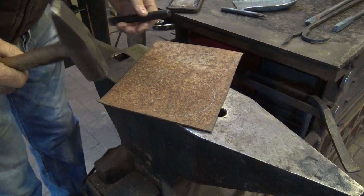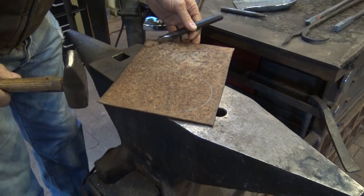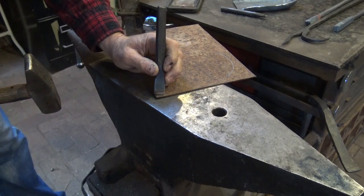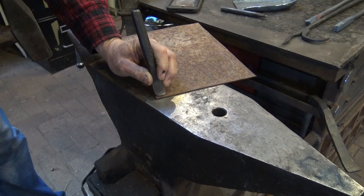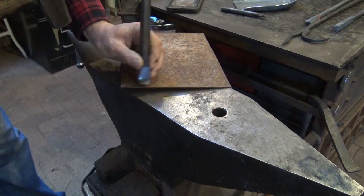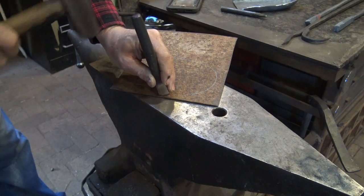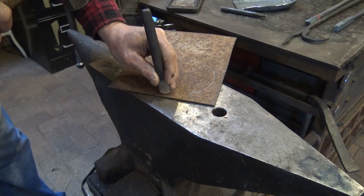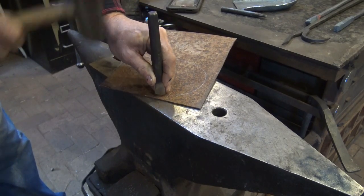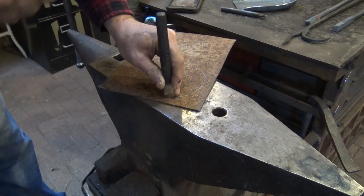I'm going to cut this out right on the anvil, but I want to be very careful not to cut all the way through — it's hard on the anvil and it's hard on your chisel. So try to avoid going too far. If we're going to cut all the way through, I'll put a piece of scrap on here. You just want to work the chisel, and you can rock it and leave part of it in the cut as you work forward. You don't have to be perfect to the line — it's helpful if you are, but these always need a little bit of filing or grinding when you're done anyway.